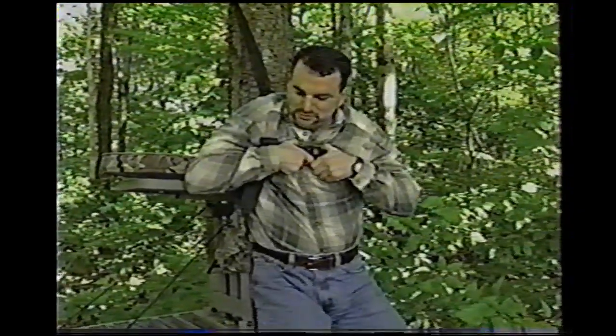Although these devices are designed to keep you from hitting the ground, the physical stress on the upper body associated with hanging suspended from a properly worn chest belt or chest harness may restrict arm movement, interfere with breathing, and can lead to unconsciousness in a matter of minutes, followed by death. If you fall while wearing a chest-type fall restraint device, it is critically important that you climb back onto your stand or climbing system immediately to relieve the stress and pressure.